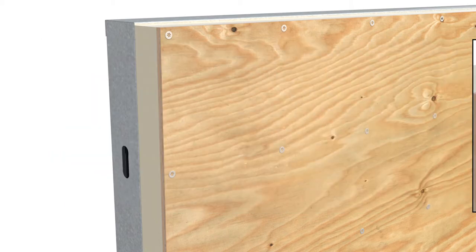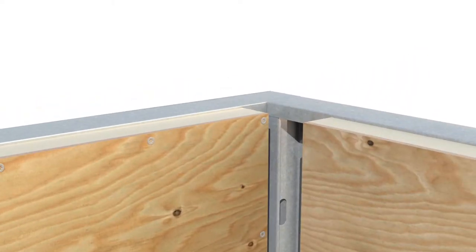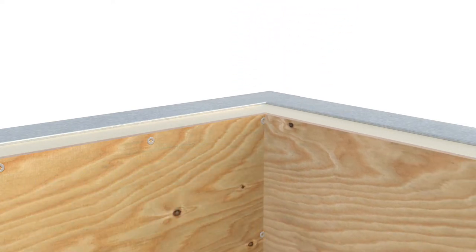When installing Hunter Xci Polyiso wood composite products and you come to an inside corner, you need to take one of the two panels that butt together and cut back the wood portion only of the panel, so when it slides together with the other panel, the foam from one panel butts to the foam of the other, and the wood butts together, not leaving any polyiso exposed.